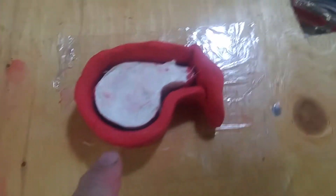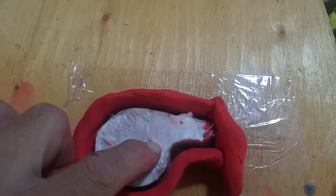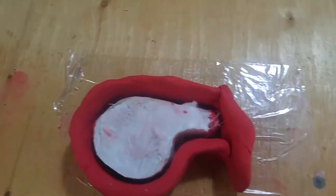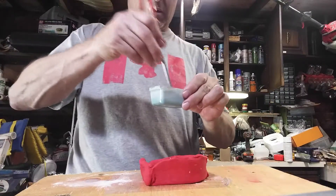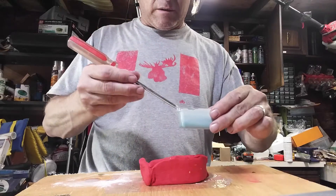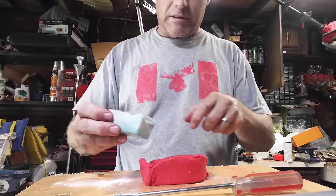Another quick and dirty mold. I'm going to make some thickened fiberglass — just pour it in around there. I'm thickening it with microspheres; they're little white powder things. That's what this stuff is on top — I made it at the end of that last batch, made a little extra to thicken up the parts where the bolts go through. I'm going to clean this off a bit, and that is my thickened fiberglass resin — I'm just going to pour it around and we'll let it sit and do its thing. I've cleaned my piece and given it a sand so that this is going to stick.